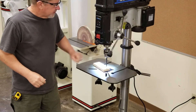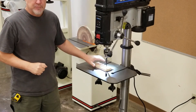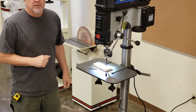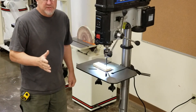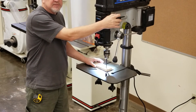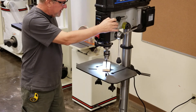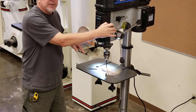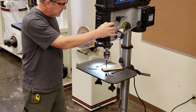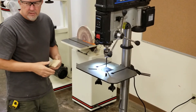While you're drilling, if you lose your grip and the material begins to spin, it's going to spin very quickly. Do not make the mistake of trying to reach out and grab it — all that's going to do is give you a bruise. If the material starts to spin, the first thing you do is shut the machine off. Cut the machine off, wait until it comes to a complete stop, then remove the material. Be thankful you don't have a bruise on your hand, think about what went wrong, and try again.